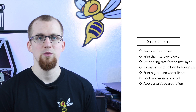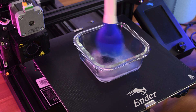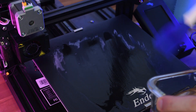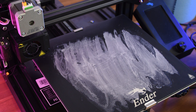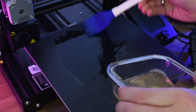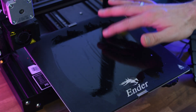There are a few household items with which you can increase print bed adhesion. Warm water with salt or sugar dissolved in it will leave a fine layer on the hot print bed. The salt solution leaves a fine crystalline layer, making the surface very large with many microscopic depressions for the filament to cling to. In the case of dissolved sugar, a crystalline layer is also formed which is additionally very sticky. However, this method in particular requires a lot of cleaning after the print is done.